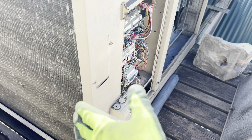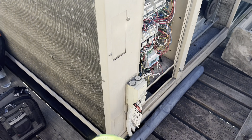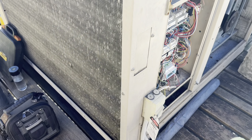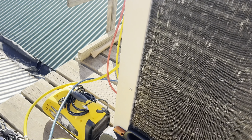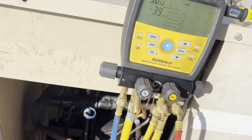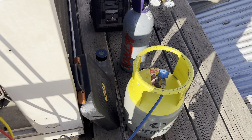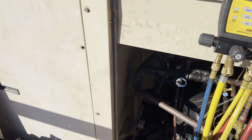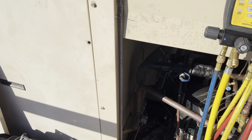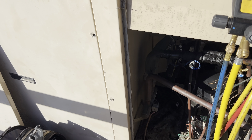Just did a real quick hit in the evaporator — no hits there, no hits on that side of the coil. Refrigerant's heavy — it drops — and that thing's very sensitive so if there is something there I usually pick it up. No hits along here, no hits on this side. The only two times I'm getting a hit: the Schrader core and the depressor. I feel pretty confident. Very confident we can start ripping out the gas, see how low we are, do a pressure test as well, and if that indicates there's still a leak after we've replaced everything, we'll continue further down the leak test path.